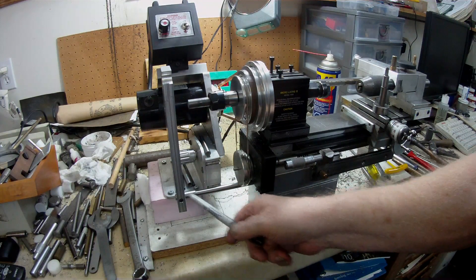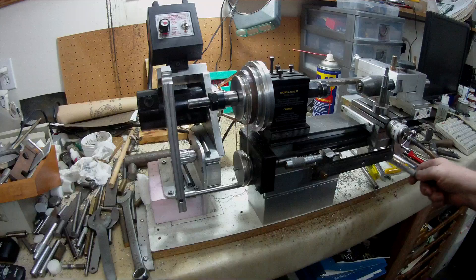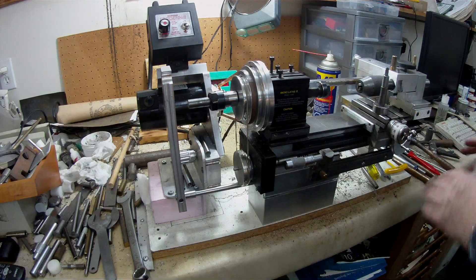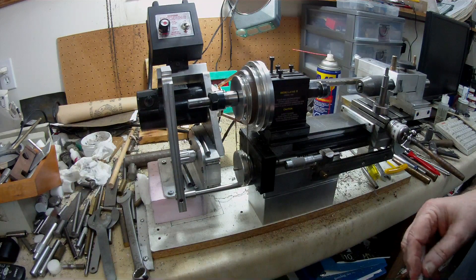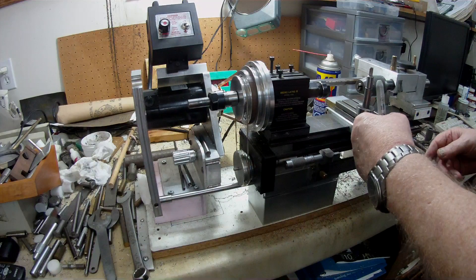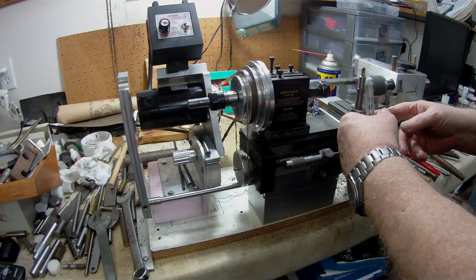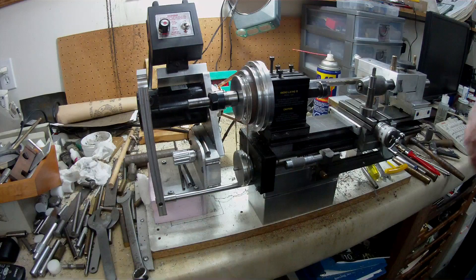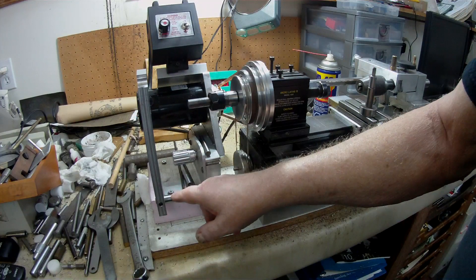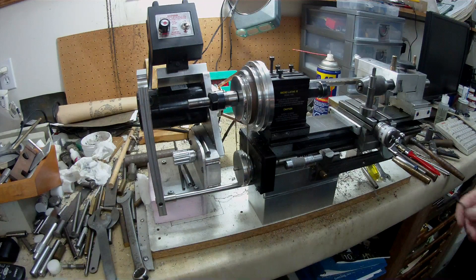By going with making my own dies from aluminium round bar and tapping them to different pitches, I won't have to fiddle around with screws. This bar is about 15 inches long and comes out on the other side of this block, attaching to the carriage underneath. That means the rod is completely out of the way. I can't see myself doing any long threads — most of them are going to be short.